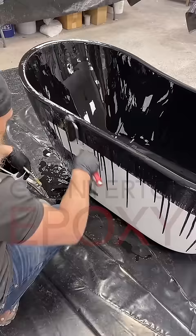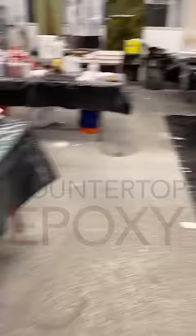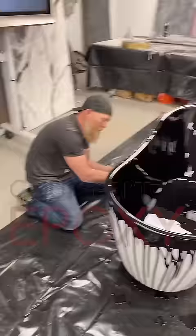Can this work on shower tile? Yes, though this isn't the exact epoxy I would use — I generally pour panels if going over tile, or we have a trowelable epoxy that works really well too. If it's a new tub, do you need a bonding primer? No — I sanded it to get a really good mechanical bond, then wiped it lightly with acetone and isopropyl alcohol to make sure there's no contamination.